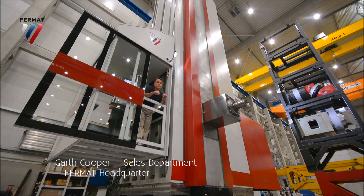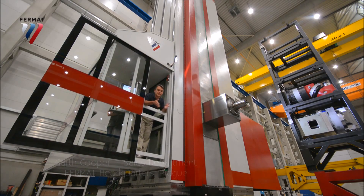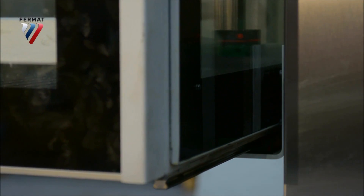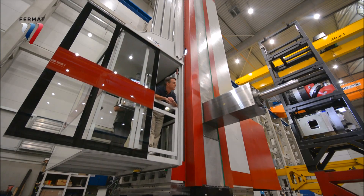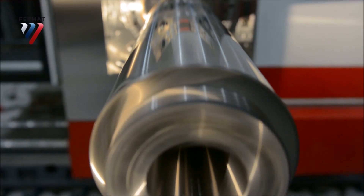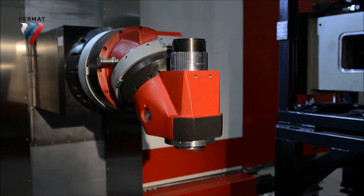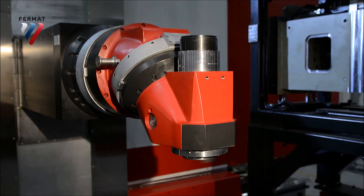The headstock is situated between two columns for maximum stability. As you can see, the cabin can move up to 750 millimeters towards the workpiece. The ram extends up to 1.6 meters and the spindle by an additional 1 meter. The spindle diameter comes either 160 millimeters or 200 millimeters, so you put big tools and do lots of heavy cutting.